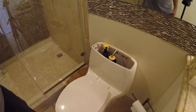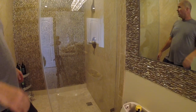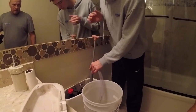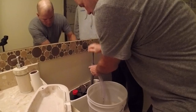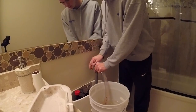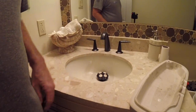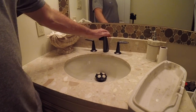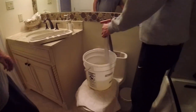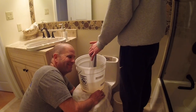Do you hear the pressure difference on the 1.0 flow on the lavatory faucet? I feel like I got no pressure. You have to give it some juice — you've got to create a suction for us. See how much pressure is on the sink. It's a 1.8 water saver faucet. Now here's the pressure of the toilet flow — there's no restriction. Ready? That's a lot of pressure.